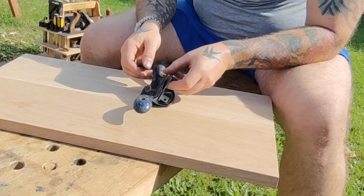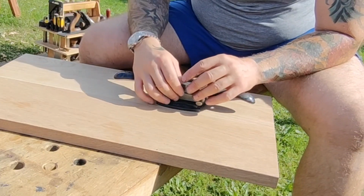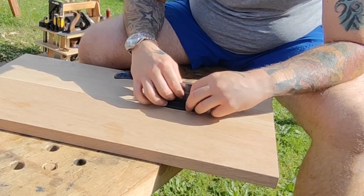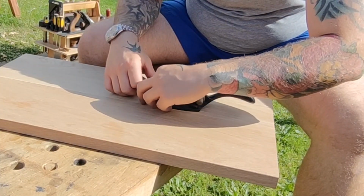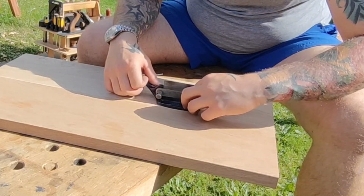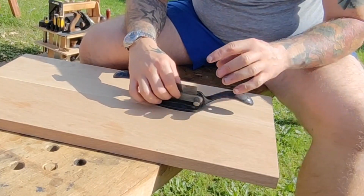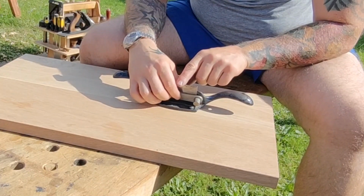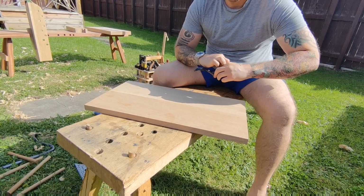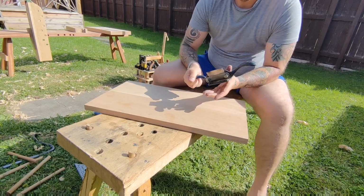So setting it up, here you can see is obviously putting it in carefully. I am using a flat surface. So here you can see I'm tightening the thumb screws up because there was too much slack in them. Then I remove about maybe a full turn on each of them. I apply a little bit of pressure onto the cutting edge and then I nip it into place, lift it off the workpiece and then I tighten it up, just finger tight.